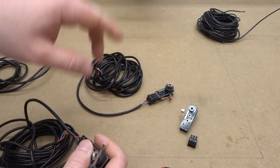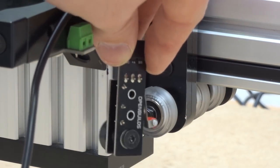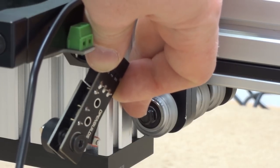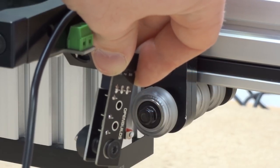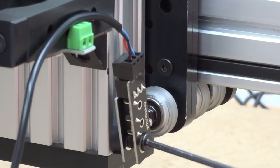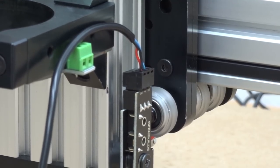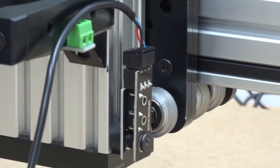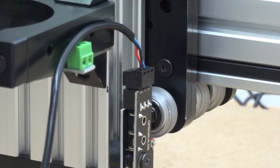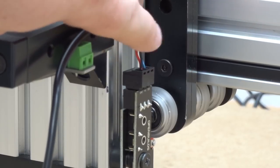Over at the Z-axis, the micro limit switch position will go on the front track and lock into place with the drop-in T-nut. The key is you want the micro limit switch to interact with the nylon hex nut on the wheel. Once you reach the bottom position of your Z-axis — your max travel — you want it to touch the micro limit switch. To test the position, bring the Z-axis to an upright position and you'll see it interact with the switch. The connector should be facing up for wire management — we'll put a slot cover in the slot so this wire runs back to the drag chain.